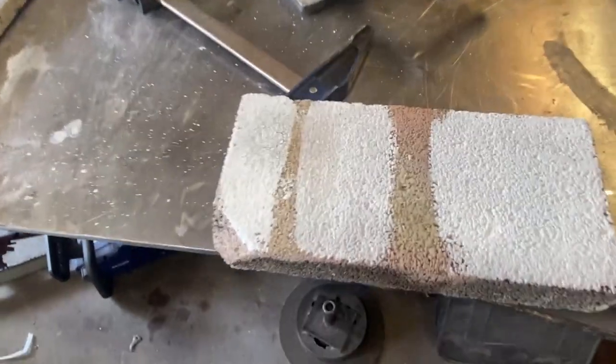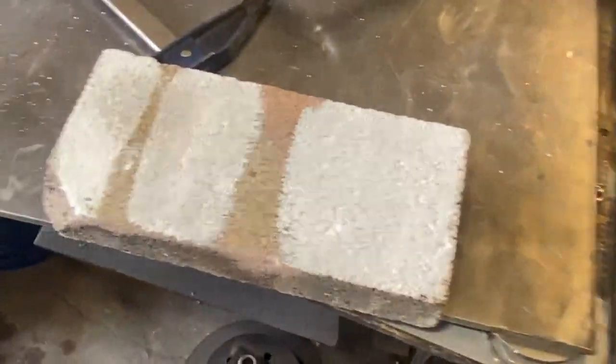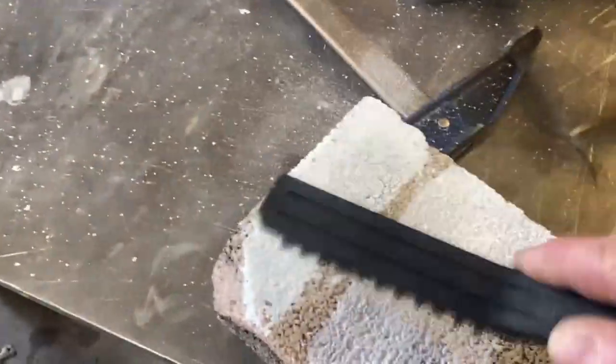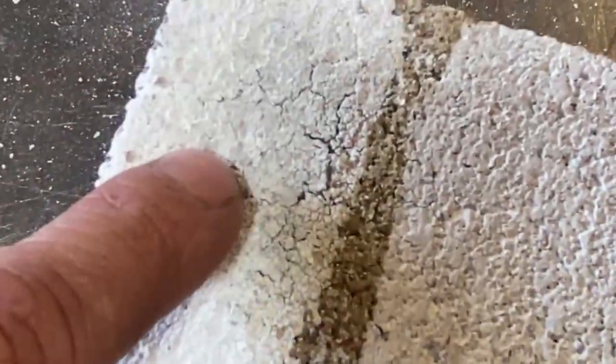Looking really good — we are still fully coated. It took some pretty heavy damage, but then again that was direct flame impingement with about 90 kilowatts of power. I'm rubbing it really hard. At this point I would imagine we have vitrified the water glass. It's a little dusty — this area here was coated extremely thick. You can see where the thin coat fared better. You're probably not getting a benefit wasting material making it any thicker — even five atoms thick, this stuff is opaque. You do want to fill up all those voids, but based on what I'm seeing here, it's detrimental to make the coating very thick on stone as well.